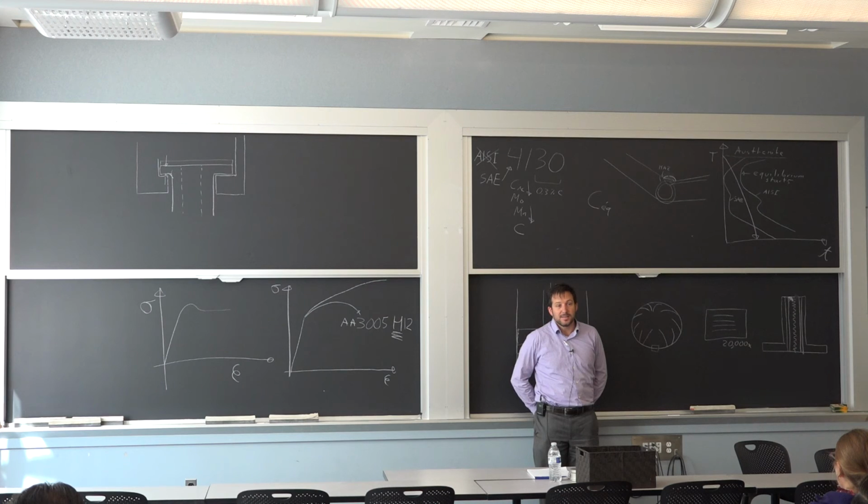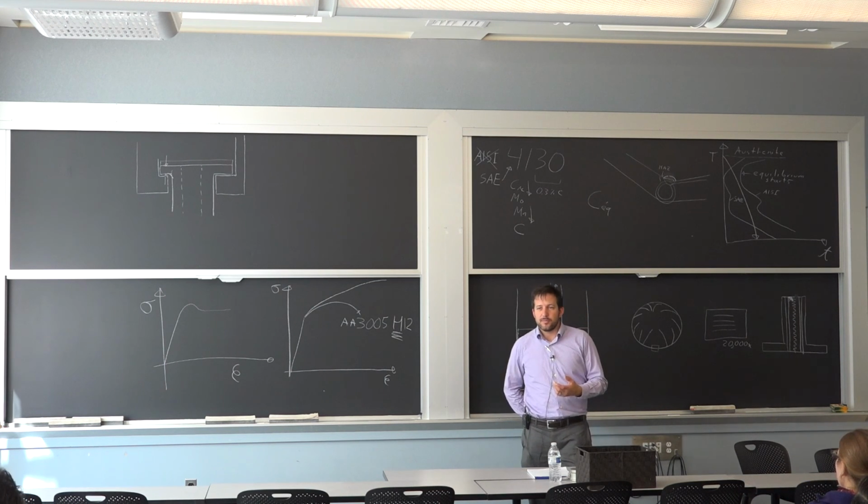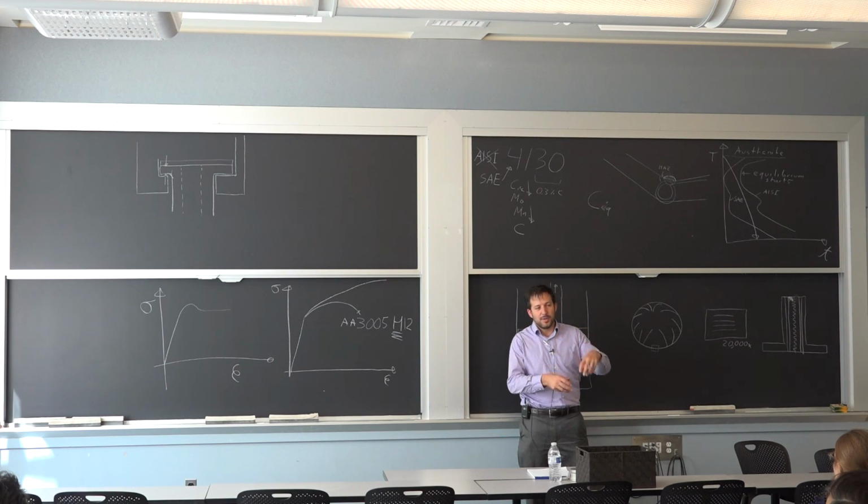It's done with plastics as well for very, very fine structures. But I think of it as a close example between powder metallurgy and our thermal spray, because you build it one by one, and you will be building up residual stresses, which is probably what is more important to remember.